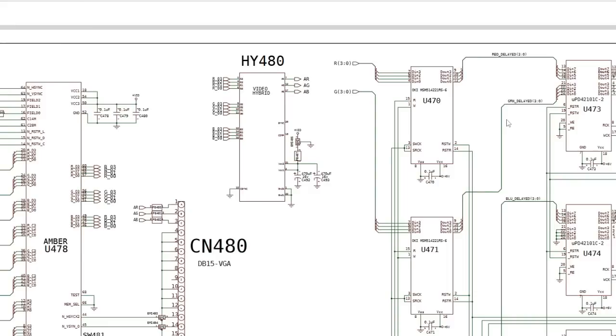On CRTs, yes, it's still noticeable to the eye, but because of the persistence of vision of the phosphor, it takes a time for the image to fade away, effectively, in terms of how it affects your vision, in terms of how you see it. It would trick the eye into seeing a full display. And the flickering is because the lines are overlapping with each other. You see one frame, then the other, then the first one, then the other one, etc.